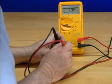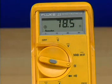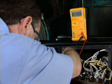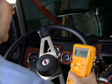The meter captures the reading while the leads are touching the circuit. A special indicator on the display shows that touch hold is in operation. The meter will beep when a new value is captured. The leads must be on the circuit for more than 0.5 seconds for a capture to take place. When in touch hold mode, the meter is always in auto range, so it will switch to a higher range if necessary to capture the reading.